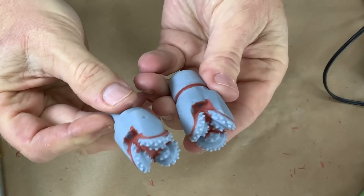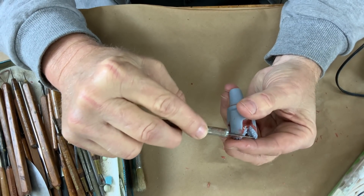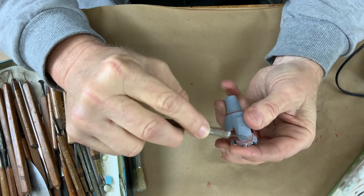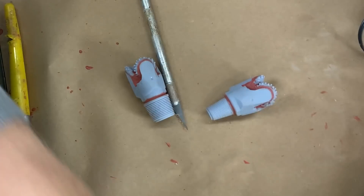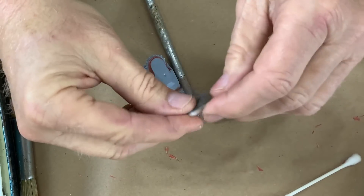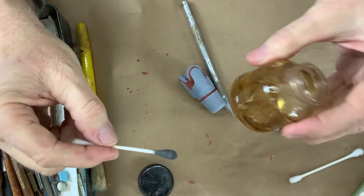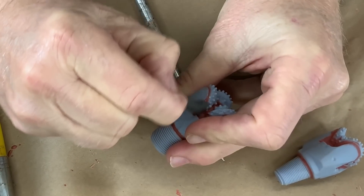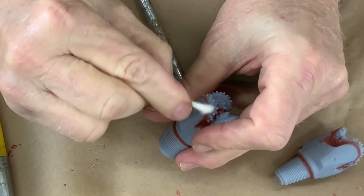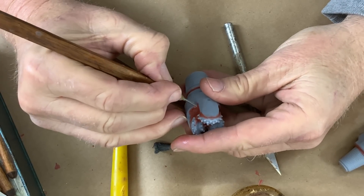Now we're just going to clean them up and polish them. That entails nothing more than just going around and scraping out all of the extra wax and smoothing out things. Here's one tip that works really well: take some 4-0 superfine steel wool and wrap it around a Q-tip. That gives you a very soft polishing tool. Then use some lemon oil — furniture oil — and just smooth out your wax all around. Then you can use the soft end of the Q-tip to sponge up your wax. I'll go around and do this whole job and come back when they're nice and clean.